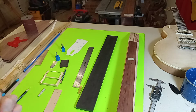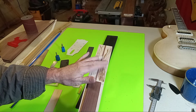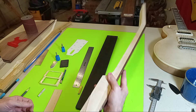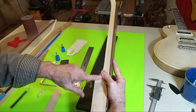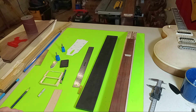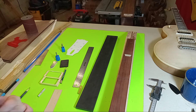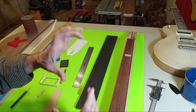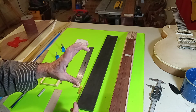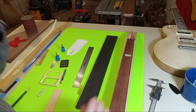On the next video — not sure exactly when — we'll probably have the ears glued on and I'll figure out the headstock veneer direction. This neck joins the body at the 16th fret, but I've got some other ideas I might use this neck for. I've got all the mahogany in the mail — it's all Honduran — and I've got a one-piece neck blank coming in at three by four inches, 30 inches long, so I might be able to do a single one-piece neck out of that.